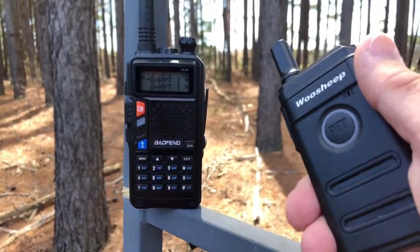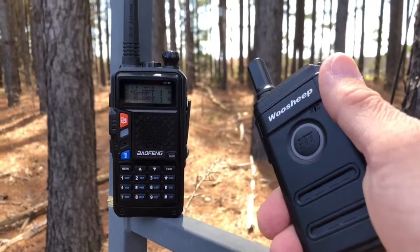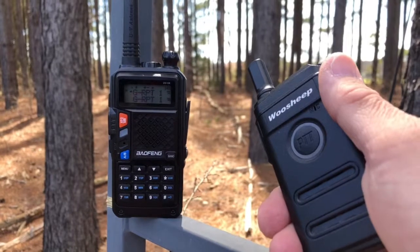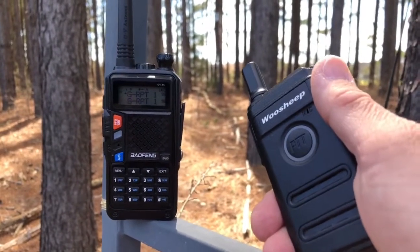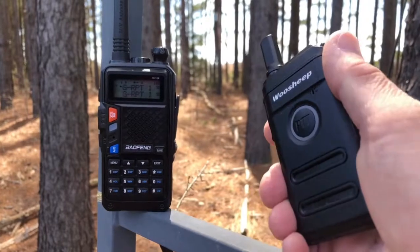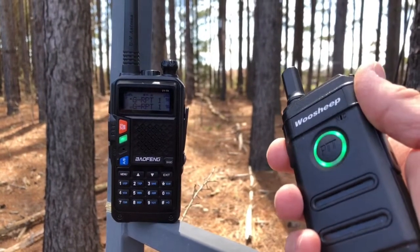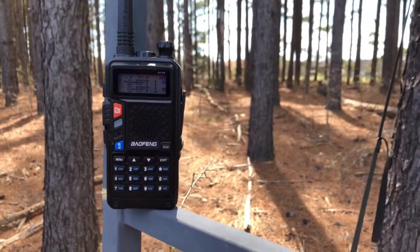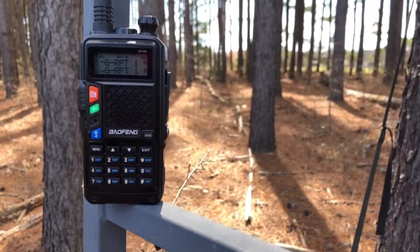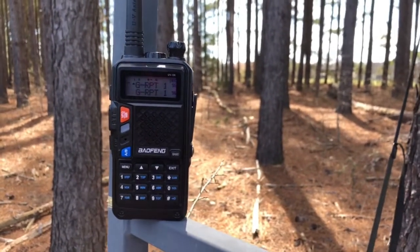So here we are off a ways into the backfield. We're going to give this a try. I know a lot of people have built these and I've seen comments about getting very sensitive front ends — front end overload on the radios — and not getting a whole lot of range, in some cases only a few hundred feet. The idea is to get a mile or miles of coverage by centralizing communications using a repeater. Let's give this a try. We keyed up the repeater — test — and it seems to be working good. That seems to be working fine, so we're going to move on to another location a little further away.